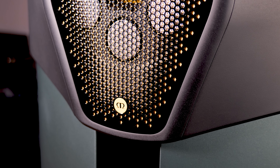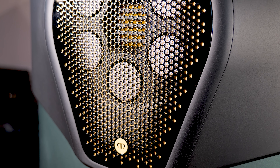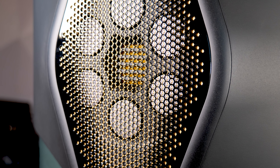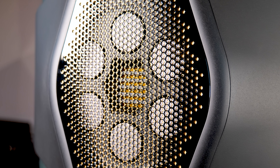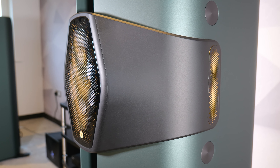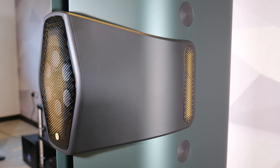Each speaker weighs over 100kg. The front M-Array bridges the two halves of the cabinet together, housing seven transducers: six 2-inch mid-range drivers and a third-generation Monitor Audio micro-pleated diaphragm tweeter. The drivers are all packed very closely together and designed in sync with the baffle and special dispersion pattern in the grille, to achieve the best point-source sound and driver integration.